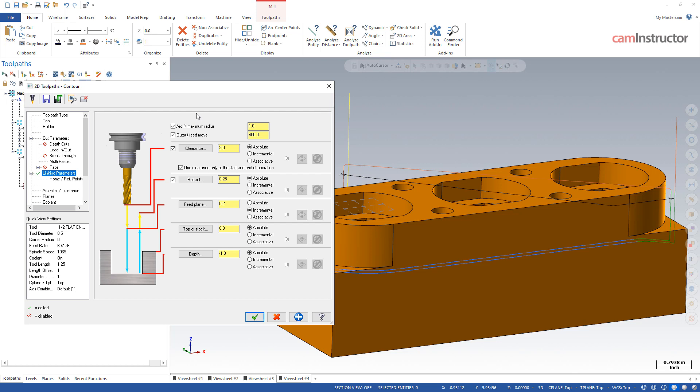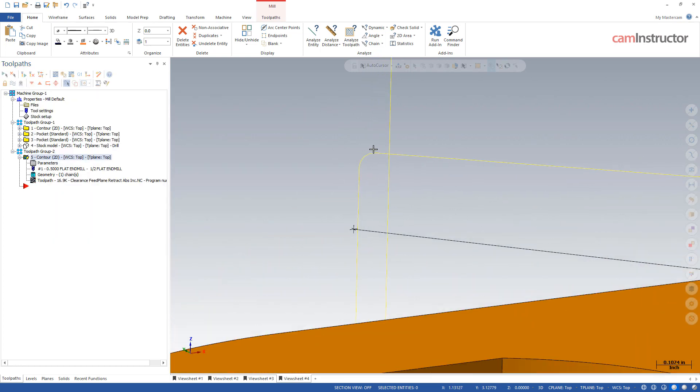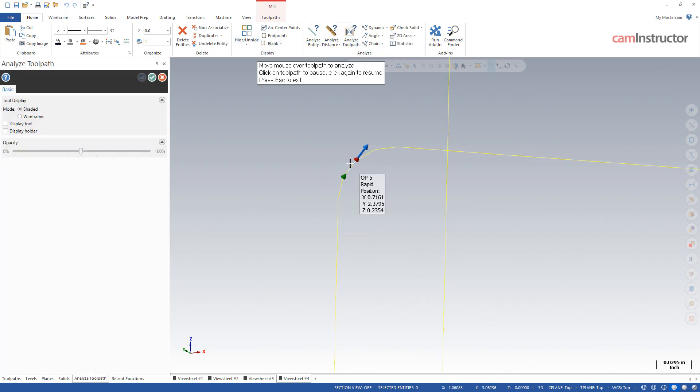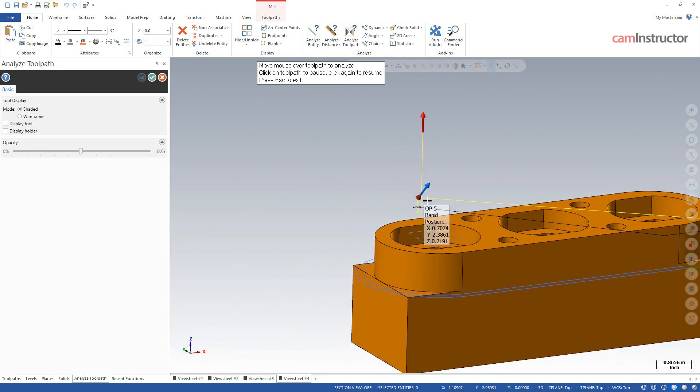If needed, you could also try disabling the G01 output and outputting those arcs as rapids. You're going to see the same result though — it's still going to be individual lines of code. How much more fluent that makes it when these are all small G00s depends on the machine that you're using. Just know you can output them as rapids or as feed code, but typically I think the most common use case will be to output as the G01 high feed rate motion.